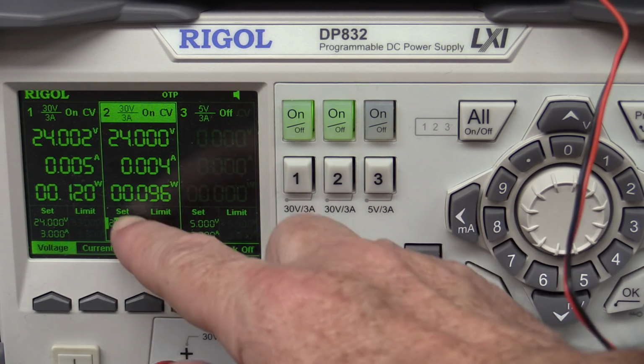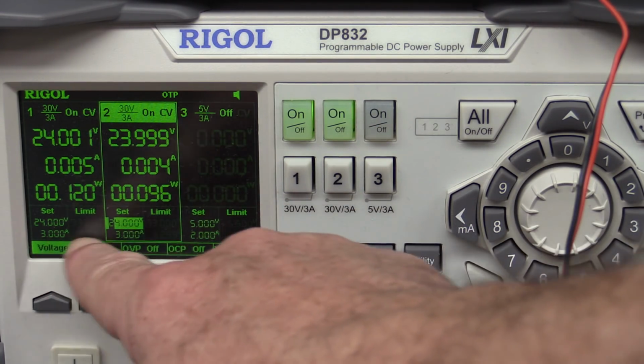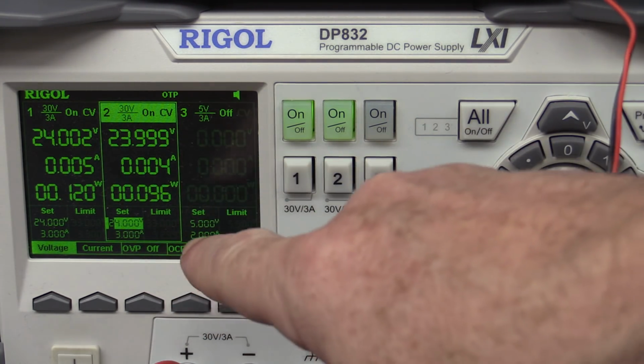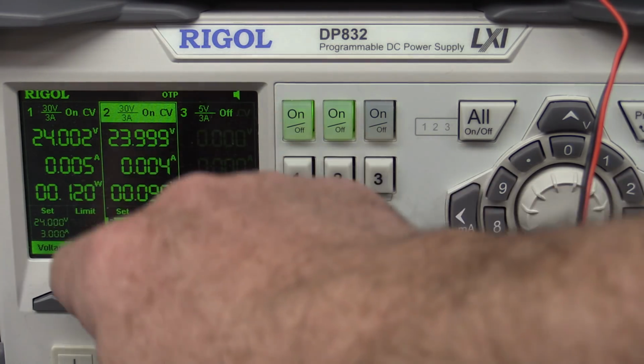But you do have to be careful setting a low "safe" current output limit, because you can get power-on surge currents, and then the power supply that you're powering your converter with may go into current limiting mode. It drops the voltage, and that causes a problem with your converter, and that can ruin your day. So anyway, I'll just set it to 3 amps.